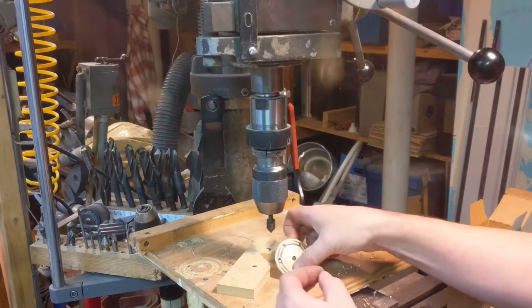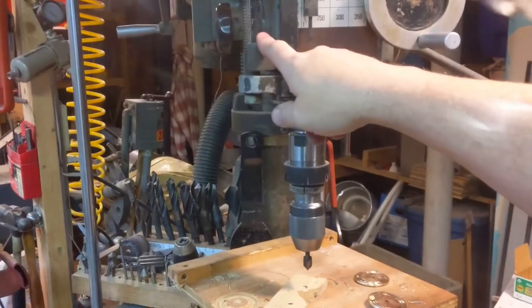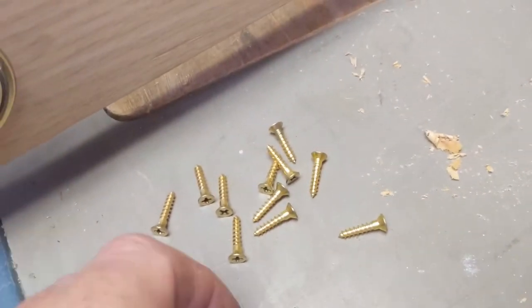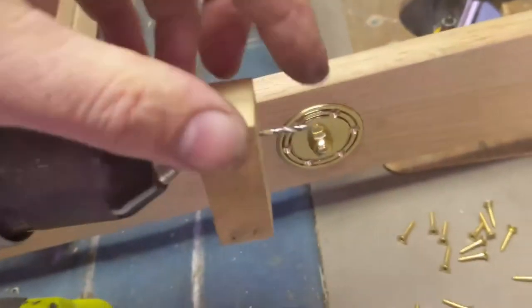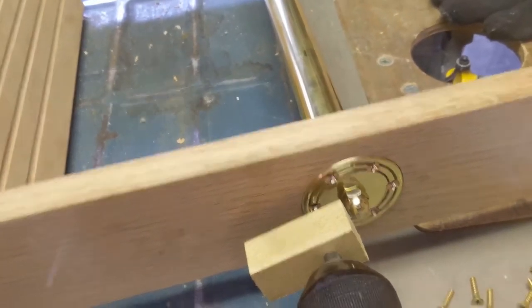Now with the center holes drilled, I have a countersink in here. Through trial and error I found the perfect depth to where that screw lays flush. I'm using the depth stop so I can just pull it all the way down until that nut bottoms out against this bracket, and my hole depth is just right. I've gone through and polished the heads of the 12 screws that will hold these in. It's really important that I not drill too deep or I'll come through the other side. One of the easiest ways to control depth in a situation like this is to simply drill through a little wooden block and set your bit in the chuck so that your stick-out is appropriate. Then I just hold this up against this edge and drill as deep as I can against the guide.